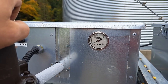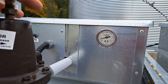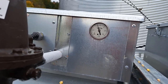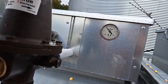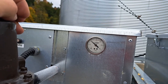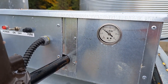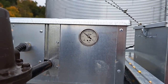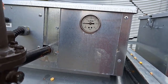I want to make sure my burner is cycling from high to low. We're running a 10 on high — just high enough so that it cycles high to low to know that we're up to the set point. There, now it went to low.